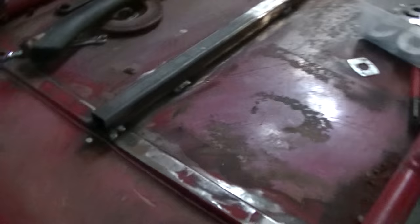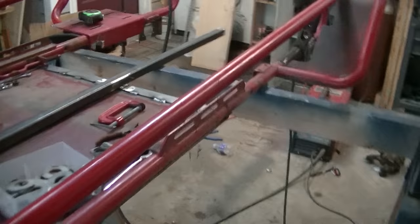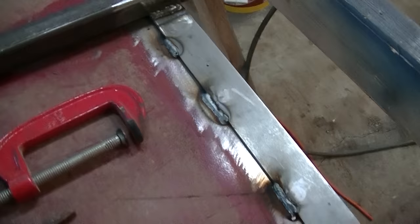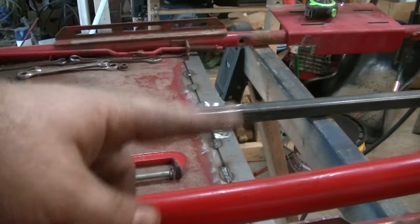So I got that piece of square tubing ran down. We welded it right there as well as tacked it all the way to the sheet metal. I'm probably going to put another tack in this area here. Then I took this piece of flat stock and tacked it to the sheet metal as well as to that square tubing, and ran it across — it is welded underneath as well. So that gives it a little bit more of a brace. It still needs quite a bit because that's just a piece of eighth-inch-thick flat stock.